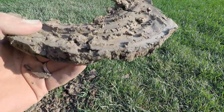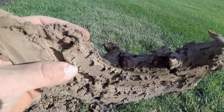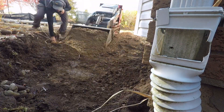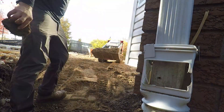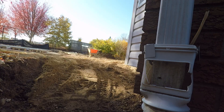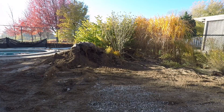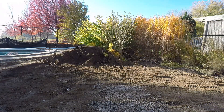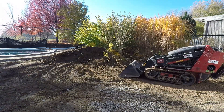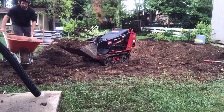For me personally in my business, even if we're hitting a good solid sandy subsoil, we're still doing the same amount of base material because we've already priced that into the project and we still want to get that depth in there. This does not really affect us unless we know we're getting into a really poor, dense clay — in that case we're going to dig a little bit more. And finally, traffic is going to come into a factor. Building a paver patio or walkway with just pedestrian traffic versus installing a paver driveway is going to require a lot more excavation.